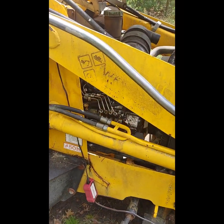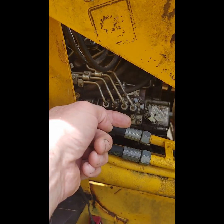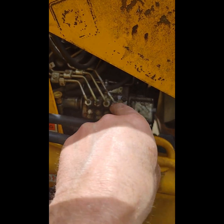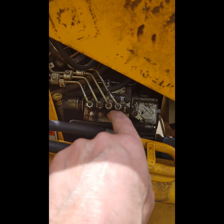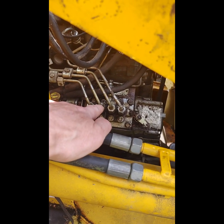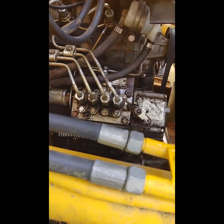And every time I found the same thing was happening, that the rack inside here, the little rod that shuts the fuel off, will move back on its own, or something, the governor maybe actuating it, causes it to move to the full fuel off position, or just enough off so it won't run. Every time I would take this out again, reach in there and push that lever over manually and put it back together, I could get it to restart and repeat.